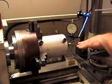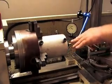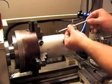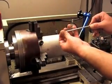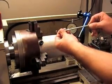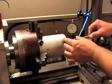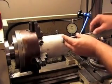Then I'll insert the short barrel — such as this Ruger Mark II that is installed — and get it roughly centered to start. Then I have this indicator rod. It has a live pilot bushing that is sized for the bore of the rifle or pistol, and then it is gradually tapered. So you're getting two points of contact with the bore, and then you can indicate off the rod.